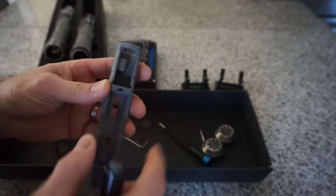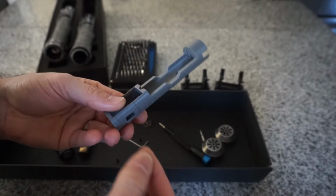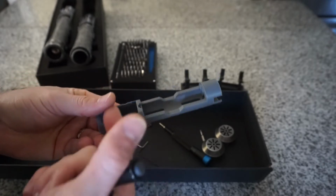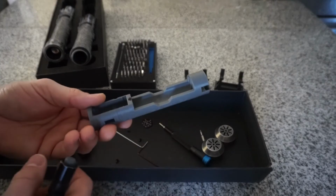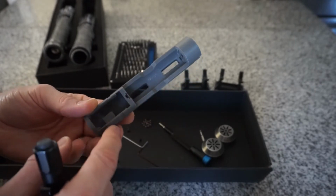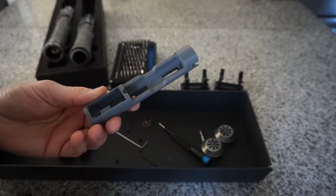But then I'll move up, I'll get the kill switch wired, right? So the 26 gauge exited here, you put that on one leg of the kill switch, and a second 26 gauge wire will come back in, and that would go to the PCB's bat plus pad. So you have your negative, that would go to bat negative, and your positive 26 gauge coming off the kill switch will go to your bat positive pad.